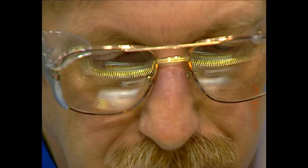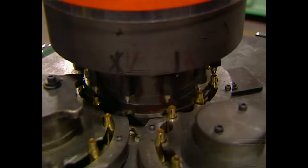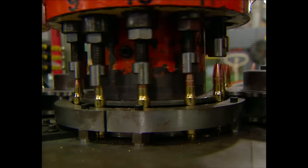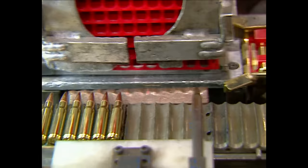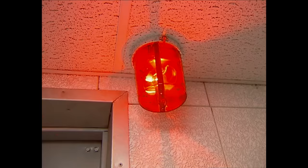This is a fully automatic operation, with bins feeding primed cases through seven turrets. Ken Hartfield is running this line, stopping only to load powder into the brass hopper and drop tube. Turret one flares and trues the mouth of each case. The powder drops through glass funnels in the ride around turret two. Next is the powder check, then bullet insertion at turret four, before seating in the ride around five. Then the crimp in six, and a final profile check before lining up to move past Ken for final inspection. The rest move past into the automatic packer that lines up ten at a time to fill the familiar red plastic carriers. Stacked together, they move into a box, untouched by human hands.